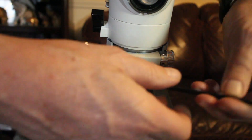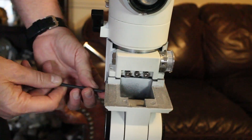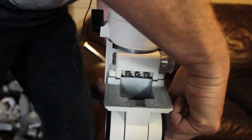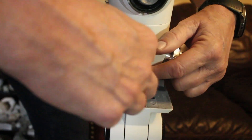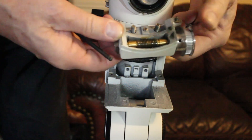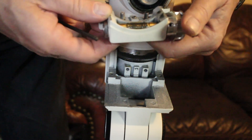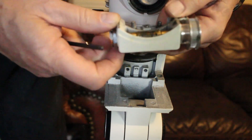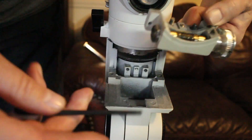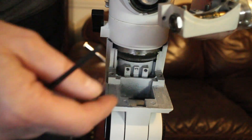The middle one here you just have to loosen a little bit. That's what a worm gear looks like. You'll notice this one has bearings here and here. You just remove this and we can pull out the worm gear itself.